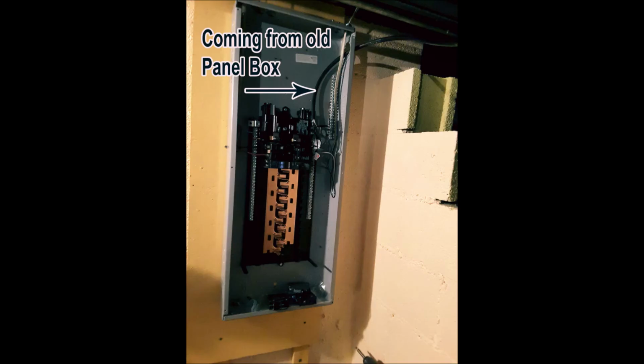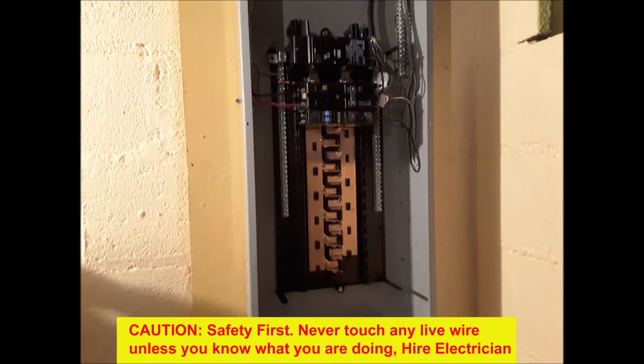Those wires removed that ended up being too short to reach the new box required additional connection boxes. I always use the deep well boxes for ease of connecting wires inside. In the new box, I could have used the neutral bar to also include the ground wires since this is the initial starting panel, but instead I used the ground bar. Both were interconnected anyway. I just thought it might look better, but it didn't.